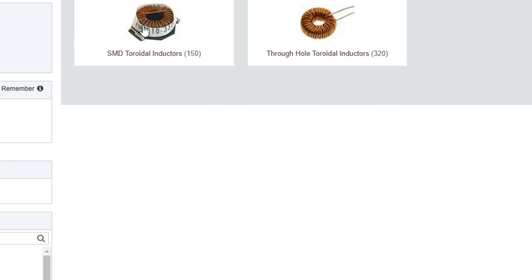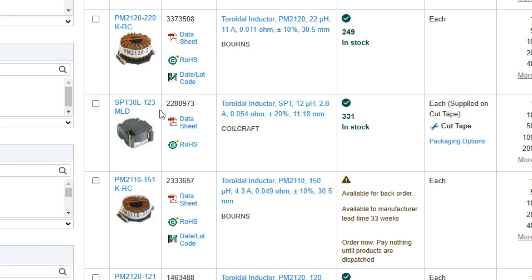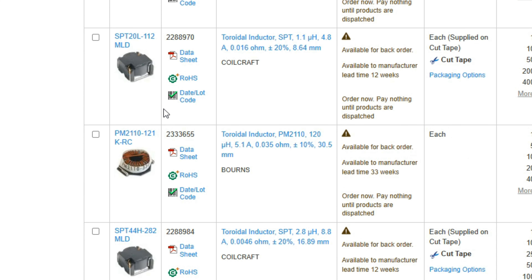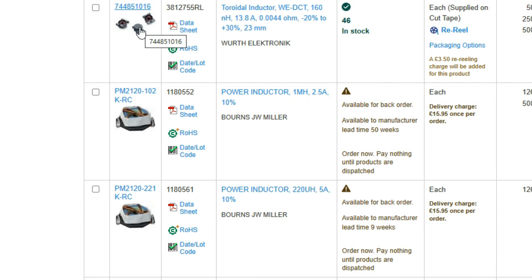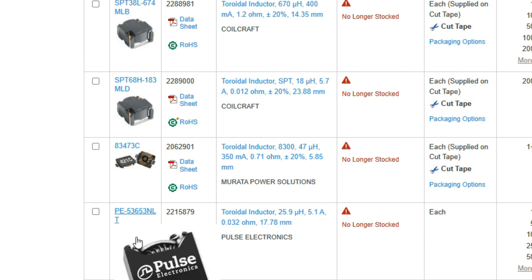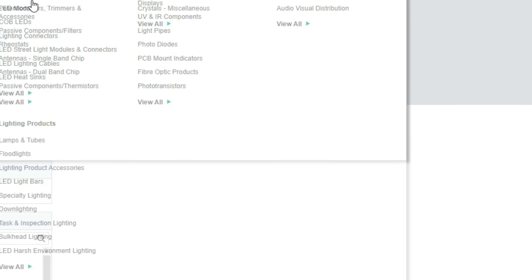Let's take a quick look at this other toroidal. It's a different shape, possibly different sizes, and you can see the way they package them can vary. Primarily it's just a coil around a bit of metal, but sometimes they've got plastic covers, sometimes metal screen covers. If you see something you don't recognize, look at the circuit diagram - if it says L25, you know it's a coil. There is no universal standard to them other than within a manufacturer, so you never really know what you're going to see.